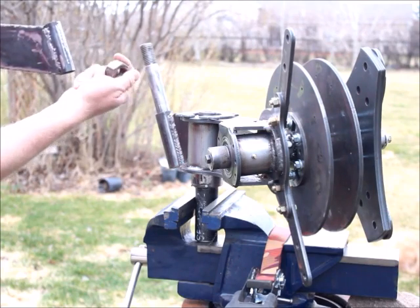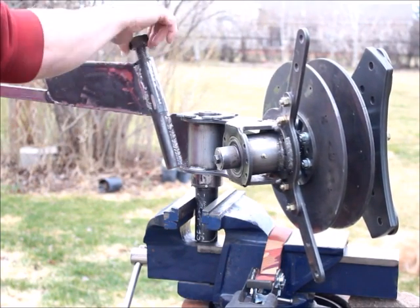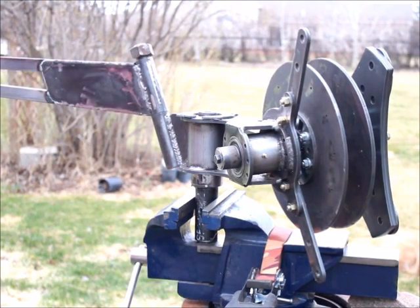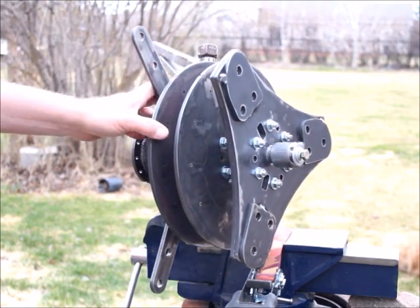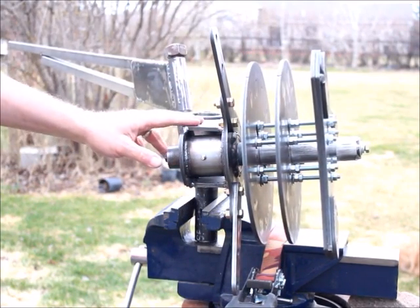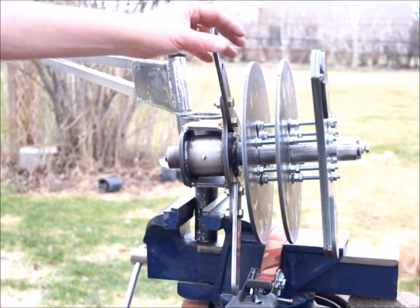There's more bearing than it's probably going to need. There you see me take that nut off of that one-inch bolt — in this case it's kind of a pin — and then that nut's going to go on top of there. I'm either going to drill a hole all the way through and put a cotter pin in there, or just use a lock nut, and that will prevent it from going around. By the way, the length of that tail there is about 58 inches, but I can trim it down — that's longer than the recipe book calls for. You saw a grease zerk in the main bearing for the spindle. There will probably be a grease zerk in the tail there, and perhaps one over by the lower ball bearing in the yaw.